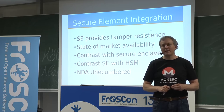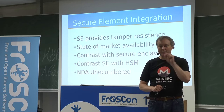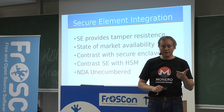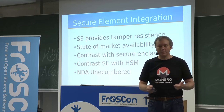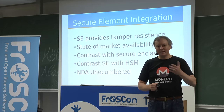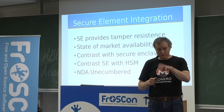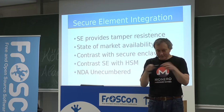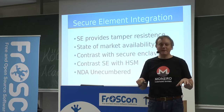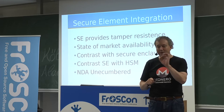Secure elements have features, for example, like you can blow fuses. You can generate a private key in hardware, which means it's not only very fast, but it's not prone to the software vulnerabilities if you're doing your own coding. It's got a few benefits. And once you generate the key in hardware, you can blow a fuse in the hardware, little fuses. If you had a microscope, you could see little explosions and smoke. What that does is it destroys the reading lines, the copper lines that allow you to read data out of that memory segment.